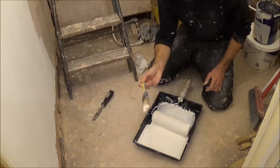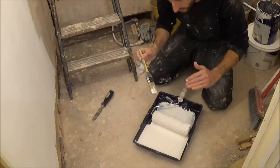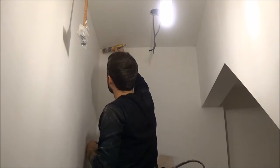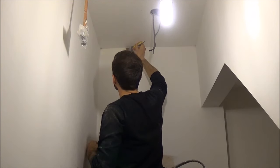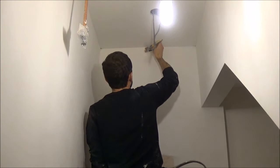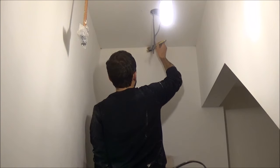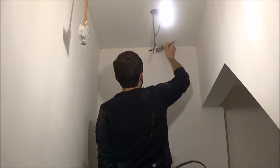Get a bit of paint on the roller and rub it back onto the grids on the tray so it's nicely covered. Then get some paint on the brush and do the corners first — cut in — and then roll them out with the roller working down the wall. You've got to be careful here because I'm using a slightly off-white and the ceiling is already white. Don't slap fresh paint straight by the ceiling — start half an inch below and let the paint spread first, then you can go back over it.